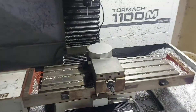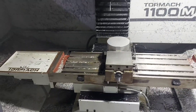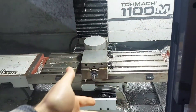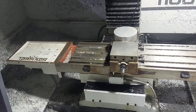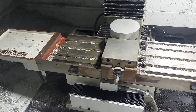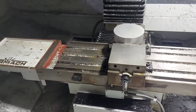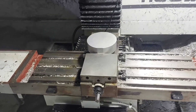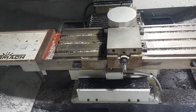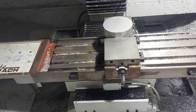I've got my five-inch round stock loaded up in the vise, ready to rock and roll. Got my probe ready. Since my last video with this mill, I actually broke my X-axis ball screw — that was a doozy. I'm not sure if my gibs were a little too tight from the factory or if I had poor lubrication. I'm also getting some rust on the bed, which is kind of hard to avoid here in Texas — really humid. I know the machinists watching this are probably screaming at me; I understand.